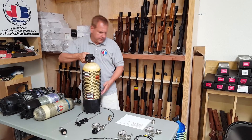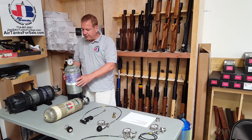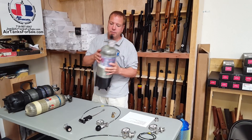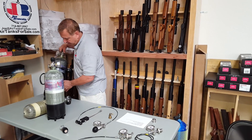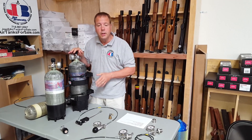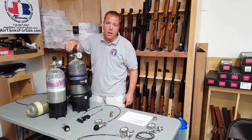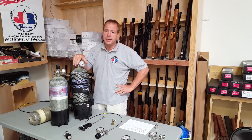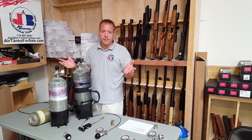So what people will do is get another kind of tank — an air tank made specifically for filling an air gun. These carbon fiber tanks are very light because they don't have to be neutrally buoyant. Their job is to just make a fireman breathe. Even though they have an air gun valve on them, the bottles themselves were originally designed for firemen to breathe. These flow air much slower because they're restricted one way. You can fill them up quickly, but when you drain them into your air gun it's very slow. Just cracking the valve on those breathing tanks, you can fill or overfill the gun instantly. With this, we try to make it 10 seconds to fill a Marauder from 2,000 to 3,000 PSI. These come with what is called a DIN connector, which brings us to our next topic — the type of valves.